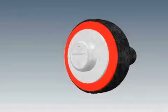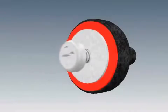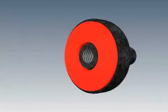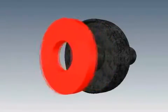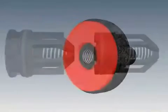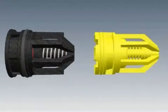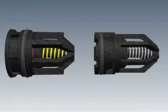To remove a damaged seal ring, remove the screw and the retaining washer. For a temporary fix, you can flip the seal ring over to use the smooth side while waiting for new replacement parts. Repeat this process with the second check assembly. Make sure to put the stronger spring in the No. 1 check assembly.